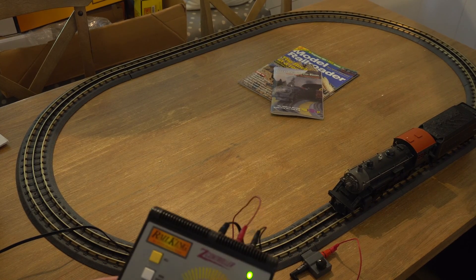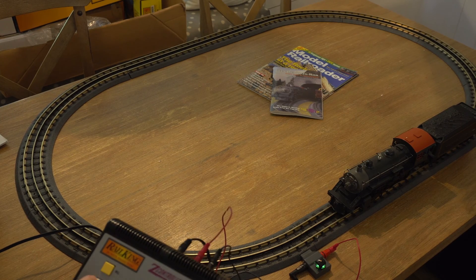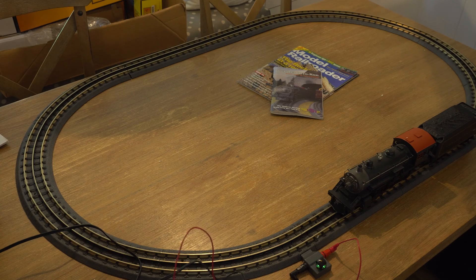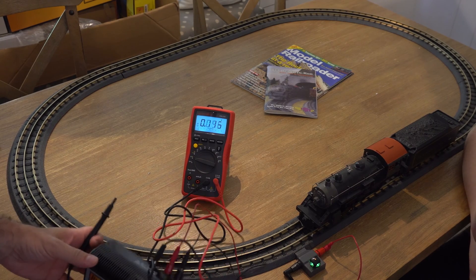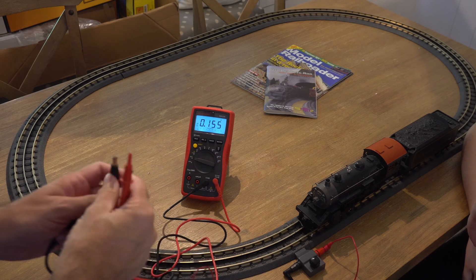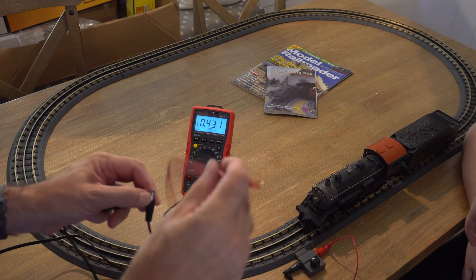The problem here is obviously the train does not go. The control box lights came on and so did the little green light beside the track, but the train itself was dead. So the first thing we did was measure the voltage on the track itself, and it seemed fine. That's how power gets to the train — through the track, the power connects to the rail. You don't want to connect both of those together on the same track; that might not end well, though I guess it's got some overload protection if the train slides across the rails.